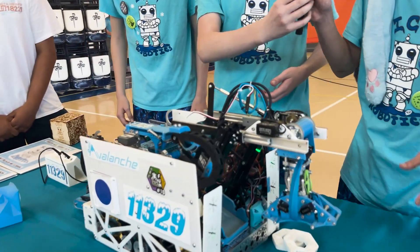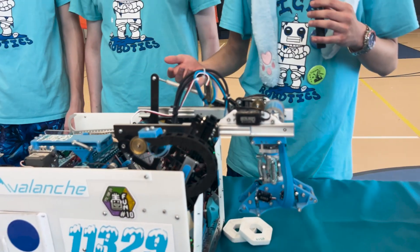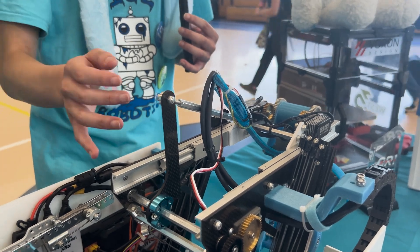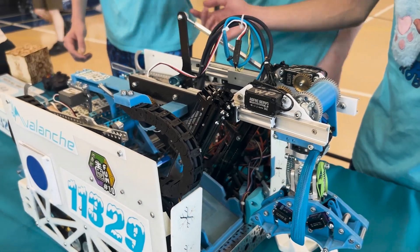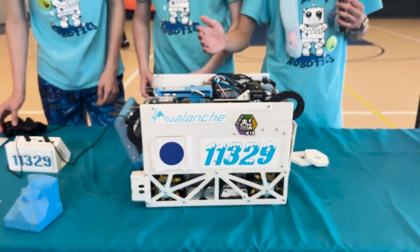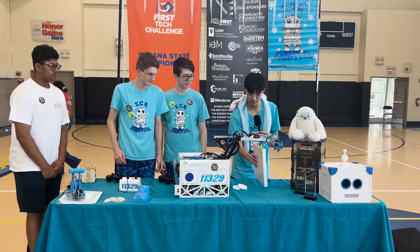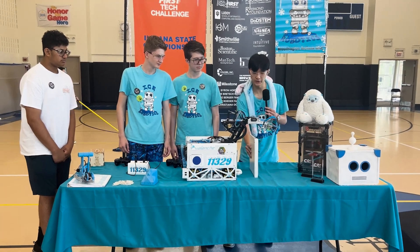This extension mechanism is something new that we added for CRI. It's driven on Misumi slides and the framing is built on carbon fiber. We have distance sensors on the front of the robot — we can use these distance sensors to have our slides always be parallel to the backdrop. We'll use this binder to simulate our tracking — through this we're able to always be parallel to the backdrop.